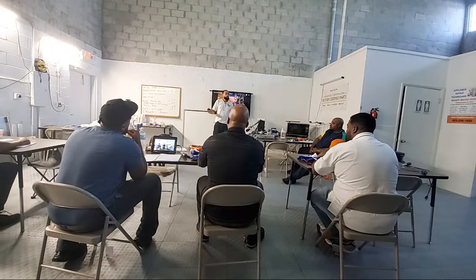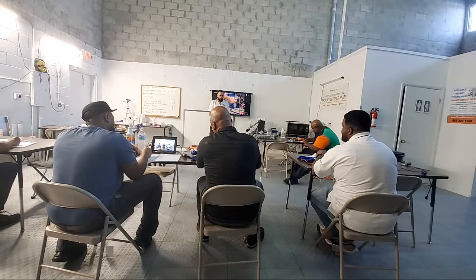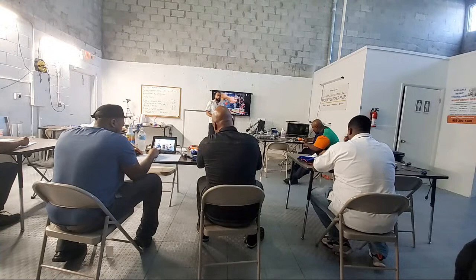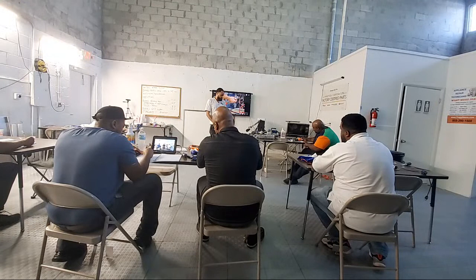On some Samsungs and LGs, there's a delay. Don't panic. Write this down. On some Samsungs and LGs, and these new refrigerators, the way technology is going, it's just a good general rule of thumb to not freak out if you don't hear the fans come on right away, okay? Wait 10, 15, 20 seconds. Now, if you don't hear it after a minute or two, okay, we got a problem. But for Pete's sake, since this is sealed system training, let's say that the fans are working.